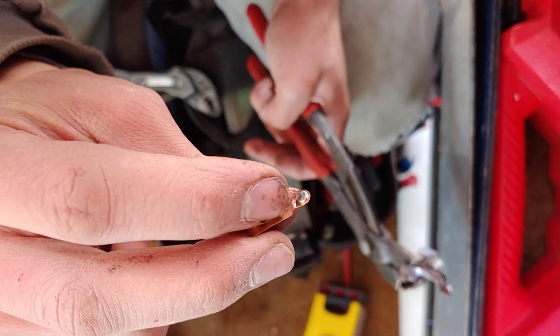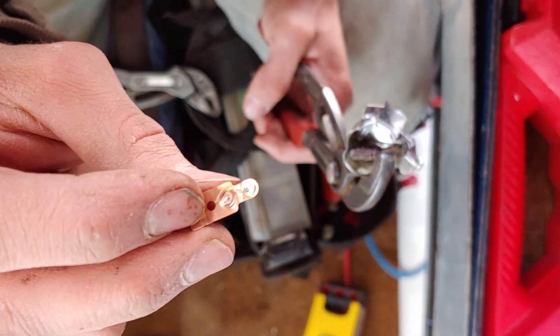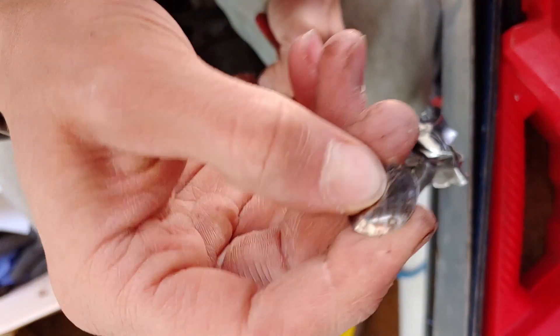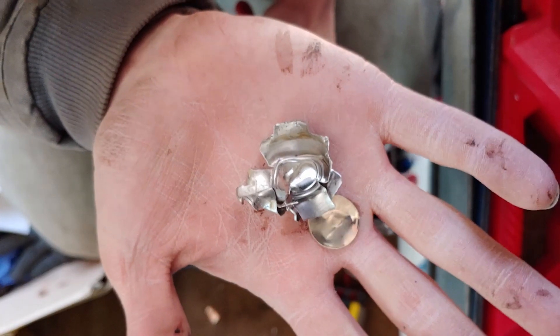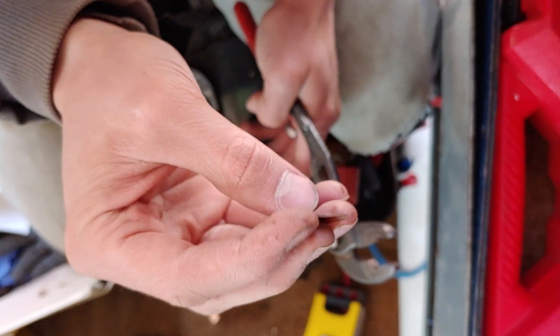This is a better contact point and it is handling 120 volts. So this must snap up, and this thermal disc pushes that ring up. They're just not very easy to get apart since they're epoxied together — at least not non-destructively. Anyway, that's all I have to say about those little thermal defrost termination switches.